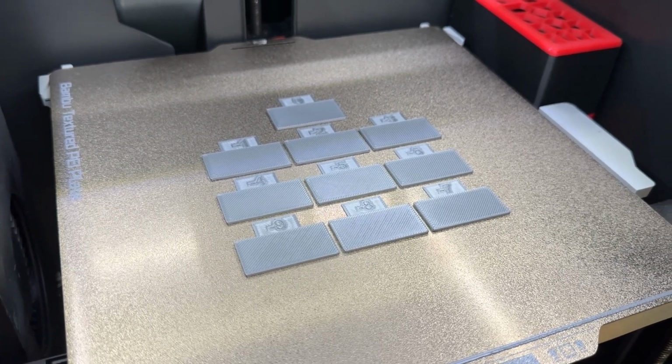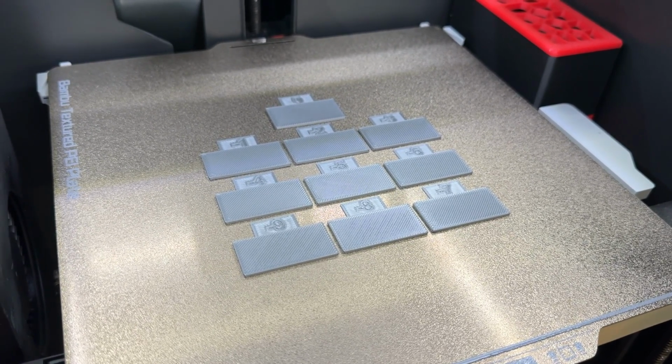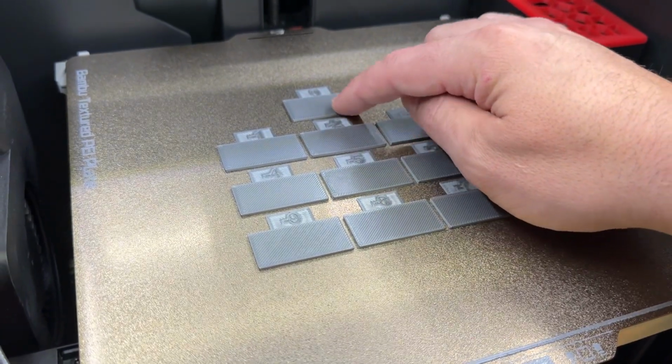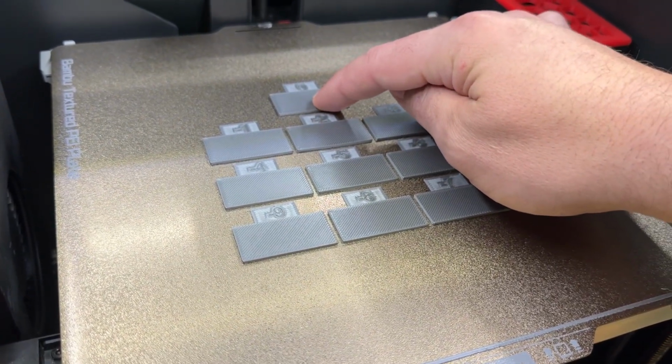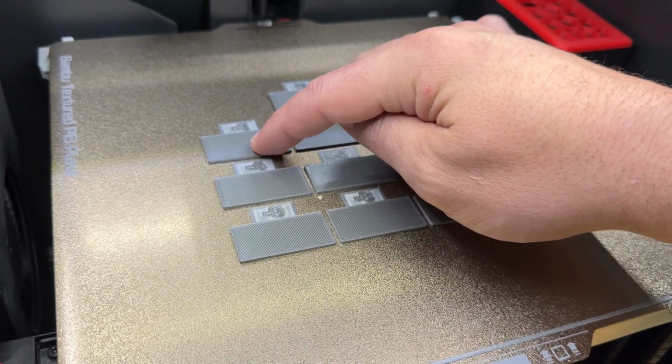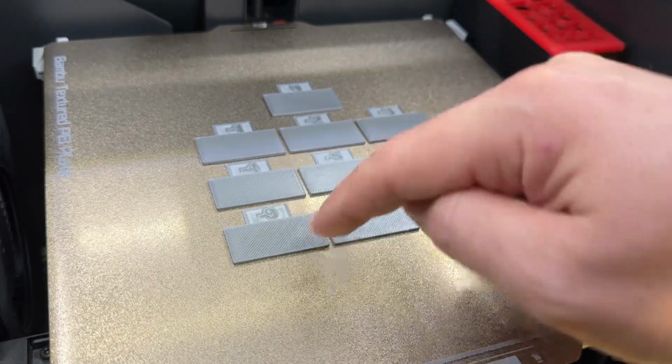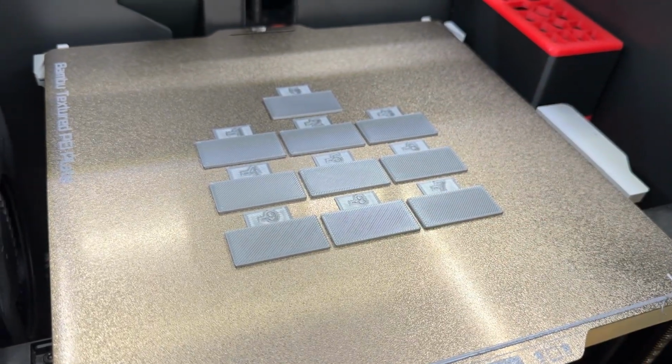So I always enter 1.0 as the starting value for the fine calibration, which means your 0 sample up here is going to be 1.0. Your -1 is going to end up being 0.99, 0.98, 0.97, etc. as you go down in flow rate.